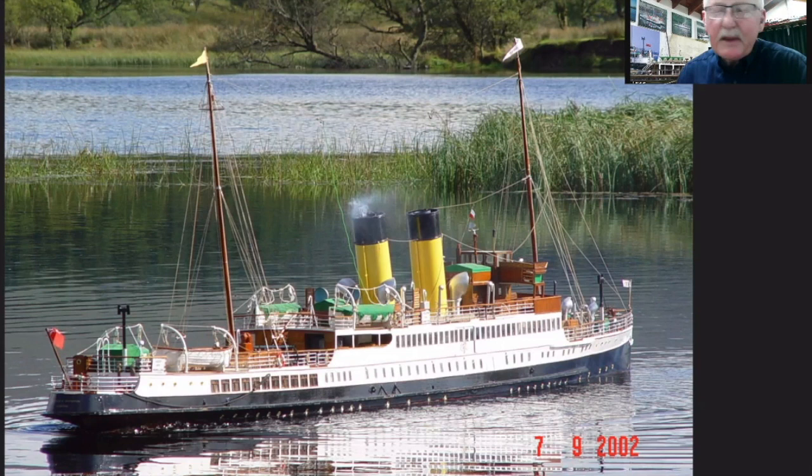I placed two parallel bulkheads from keel to promenade deck just ahead of the distinctive four windows forward of the engine room grating, and drilled holes above the waterline through prior to cutting the hull into two sections, one of about 8 feet and the bow of about 3 feet, with the holes aligned so that the two sections could be bolted together, each one having its own buoyancy. Problem solved. It would fit into the minivan if I removed the passenger seat, and I could just lift the big section without the batteries in it.